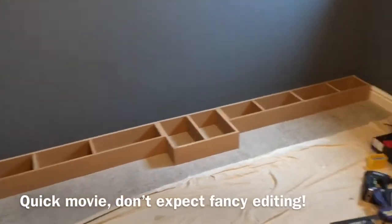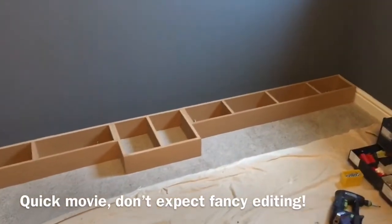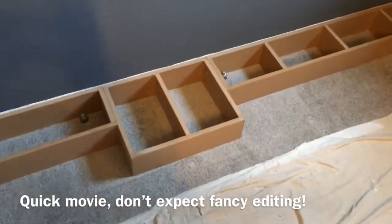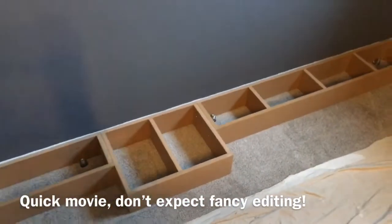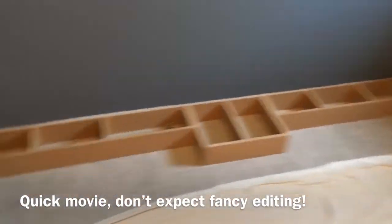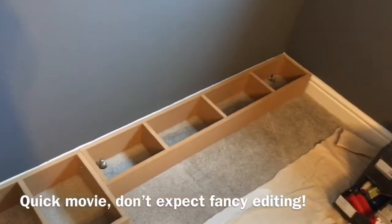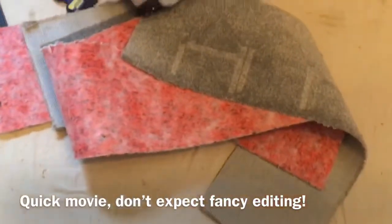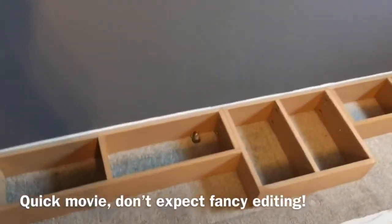This is how we lay out for display shelf units. This is the plinth which serves as the footprint of the unit, minus about 18-20 mil, because that will end up faced with a painted fascia scribed to the carpet. What we do next is we simply cut around this using it as a template so that we can cut out carpet.